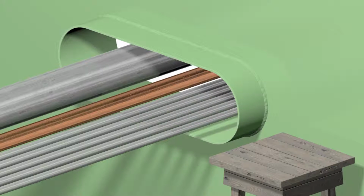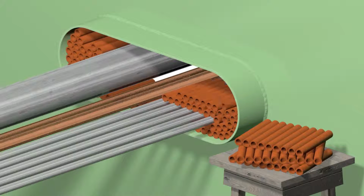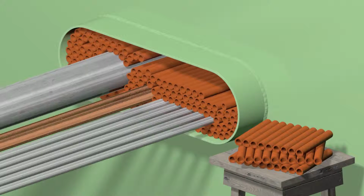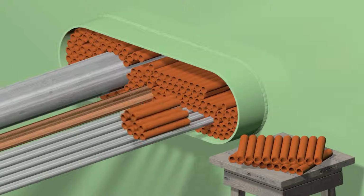The remaining free space in the conduit is filled with NOFIRNO filler sleeves. When extensions are to be expected in a later stage, the use of single sleeves is advisable, since they are easier to remove when a new pipe has to be ducted. Due to the flexibility of the set of multi-filler sleeves, the set can easily be rolled up and then pushed into the opening.